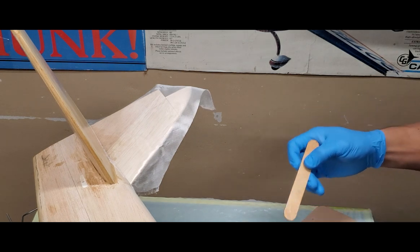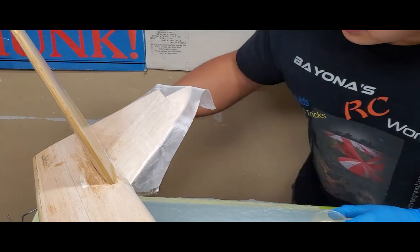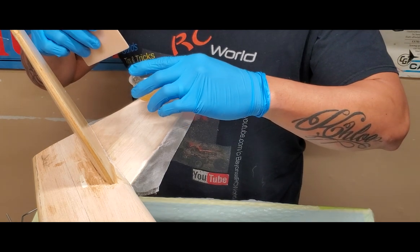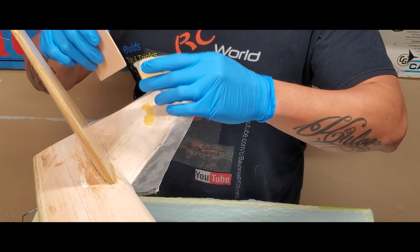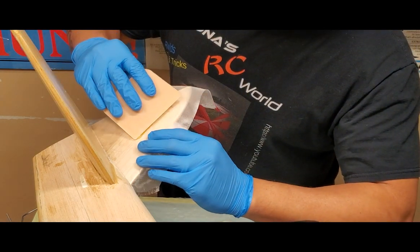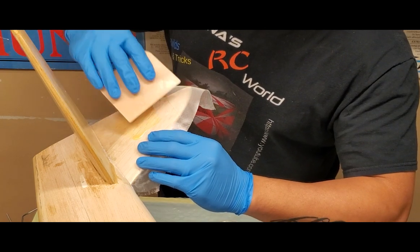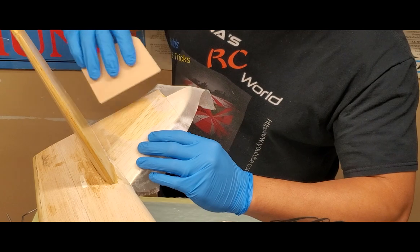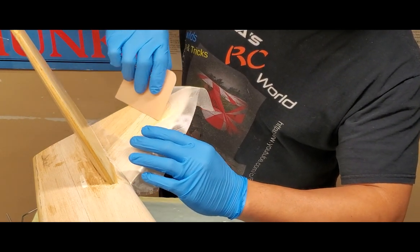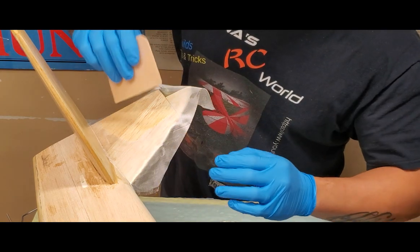Alright, guys, how we doing? Alright. So if you made it this far into the video, I surely appreciate you. Unfortunately, from here on out, the instruction is pretty much the same throughout the video. It's mixing up your resin 50-50, applying it at full strength, holding the fiberglass down while you spread and saturate the glass. I do not deviate. I do not change it up.